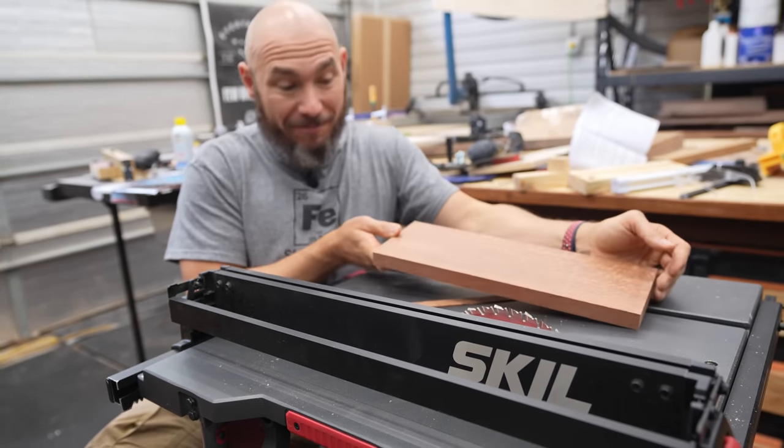This thing is awesome for $350 — this is a good deal in my opinion. Now there are some things I don't like, which I'll talk about in just a minute. But a few things that have really surprised me: number one is the power. This thing was cutting through everything, including that leopardwood, without any issues — really deep dado. It's got a good powerful motor. Another thing is it's cutting extremely accurate. I made multiple cuts — I've been in here all afternoon cutting — and you can see these little shavings I was cutting off the walnut strip, they're paper thin. The fence was holding its own and keeping everything square, which is exactly what you want in a table saw. It doesn't matter whether it's $350 or $3,500 — it needs to have a square fence or the table saw is no good. I really like the integrated stand and it's really solid. You saw me cutting all sorts of things and it never wiggled or wobbled and made me feel unsteady or unsafe around the saw, which I really appreciate.